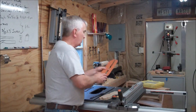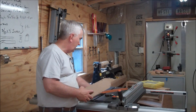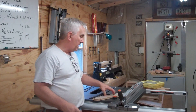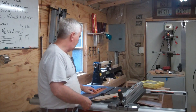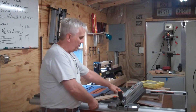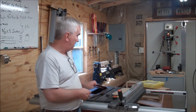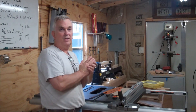I took this thing back into the house and added a revision. I got to thinking — instead of having to put a smaller blade like a circular saw blade on there, I'm wondering if I just cut a pocket in the bottom of the insert maybe about three-eighths deep, which would leave about an eighth of an inch. Then when you stick this on with the blade all the way down, maybe that eighth of an inch is enough so you don't have to swap and put a smaller blade on. I went ahead and reprogrammed it — made it a little more snug, added the part I forgot on the first one, and added that pocket. I'm going to fire up the CNC again and cut another one.